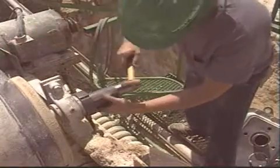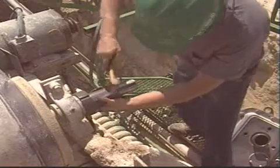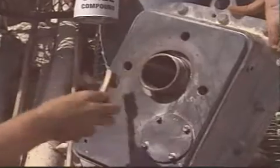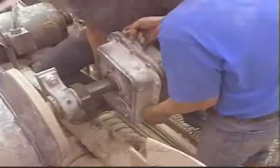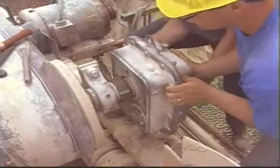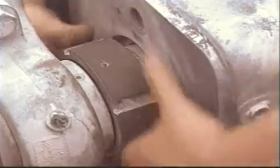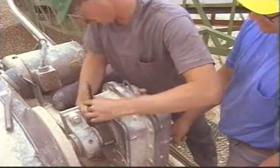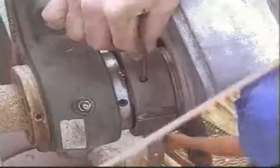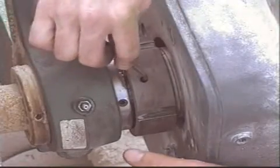Only minimum clearance at the bearing is required. Coat the hollow bore threads with anti-seize compound, align the keyway, and position the unit on the taper. Now, engage the bushing threads until the taper is seated, and tighten one additional half turn. Lock the set screw, and that's it.